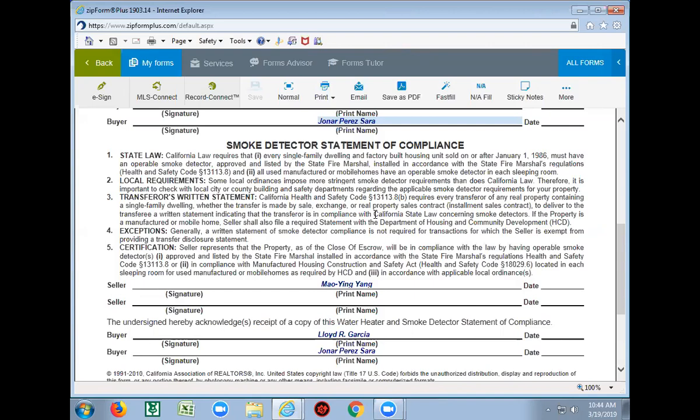So the carbon monoxide detector is only installed on each level in front of the bedroom hallway. That's it. If you've got two levels, all you need is two. Downstairs, it doesn't matter whether you have a bedroom or not, you install one maybe on the staircase or hallway. Upstairs, definitely, you have to install it in the hallway in front of the bedrooms. That's the carbon monoxide detector. But downstairs, if you don't have a bedroom, you don't need to install it, technically, because all they care about is a sleeping room and the hallway.